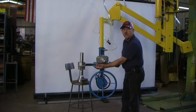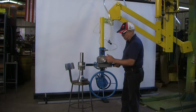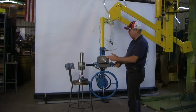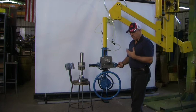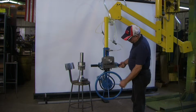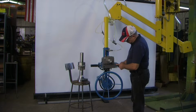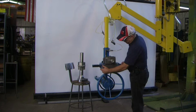You flip your arm your lift signal, which turns the air on coming from that limit switch. You turn that air on going to the regulator, and then in turn this weight dial regulator sends it back through the rotor joint to the machine for your load regulation. Now, in that position with the toggle on, you can hit the release button and it will not release until you set the product down.